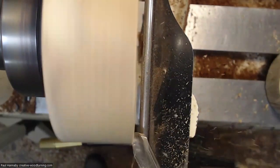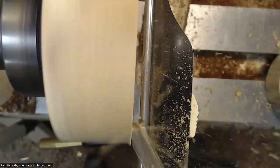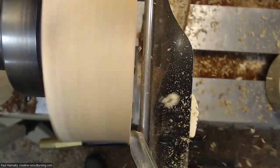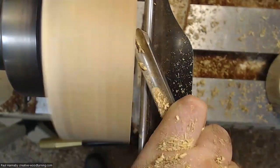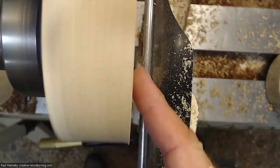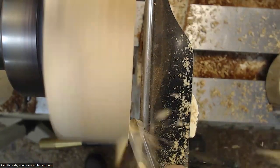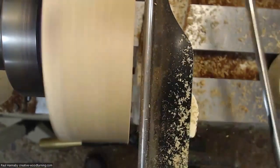Bit of a bounce on that outer surface because of the unevenness of the thickness. So I'm just trying to work that down so it's flat and I've got rid of the unevenness. And as I'm taking this cut, I'm looking at the edge across the face to see that I'm cutting it flat. So if it looks like I'm not, I can make adjustments as I go. And then once I've got there,